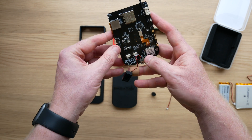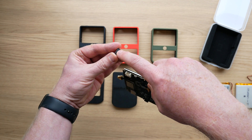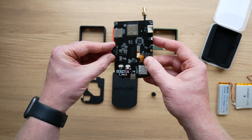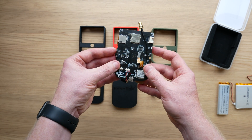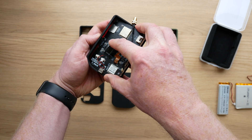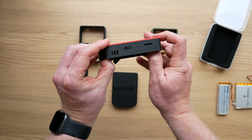The button actually isn't symmetrical. There's a tiny little line that's quite difficult to see on camera — that denotes that it goes to the front. The reason why is because this little hole isn't actually a square this time; it's actually tilted, and the reason is so that the switch can tilt in the button. It stops any stress being put on it when you actually install it. So if we take our body, you want to go in at this angle and try to get that button into the hole down here. Bear in mind, I'm doing this on camera, so I'm bound to make a hash of it — and there you go. You'll see that slots in, and we now have our button in position.